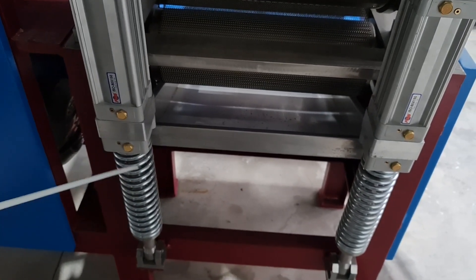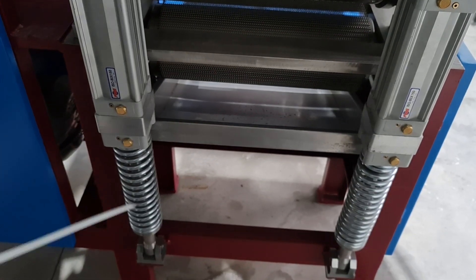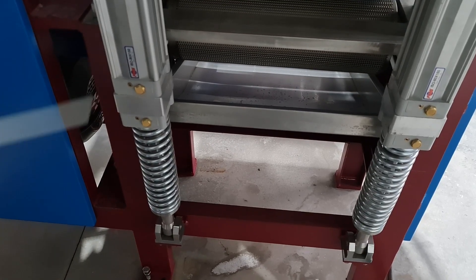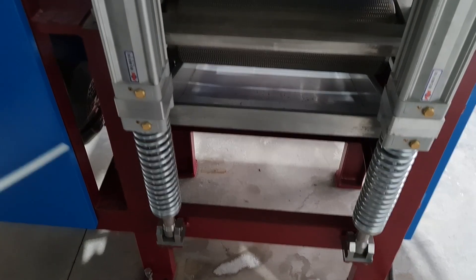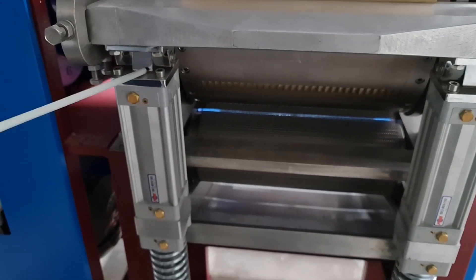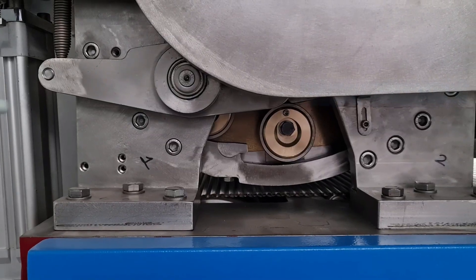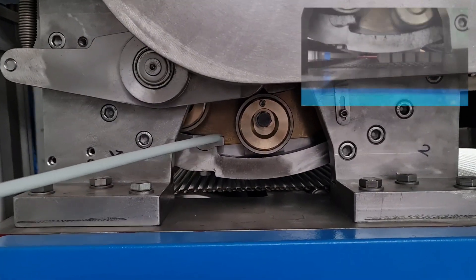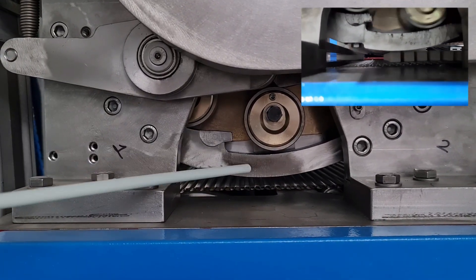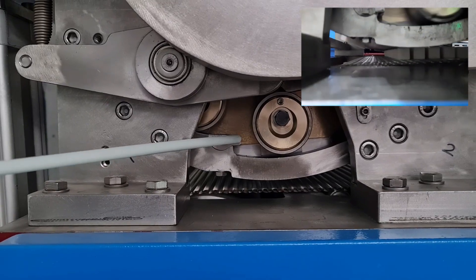Also, the roller has an inner spring which makes the operation of the pressing wall smoother. All these parts are made of stainless steel, reinforcing the entire mechanism. We also made a system where the eccentric guides that wear out over time can be replaced. The part that wears out is removable, and it's made of stainless hardened steel.